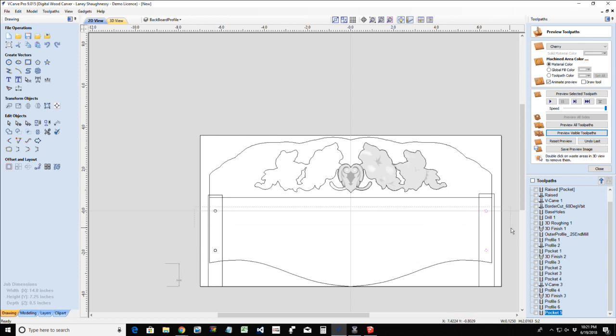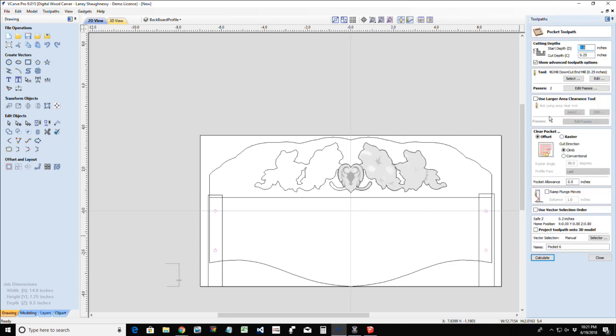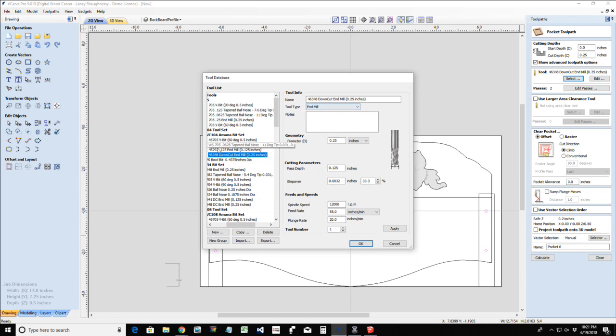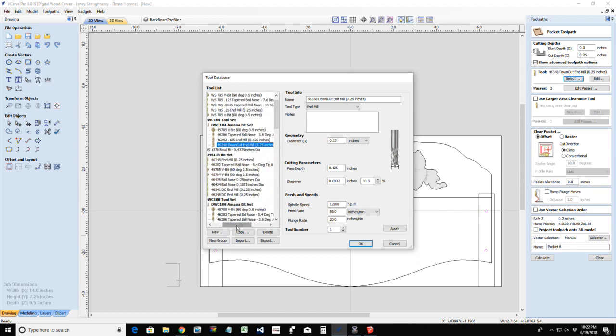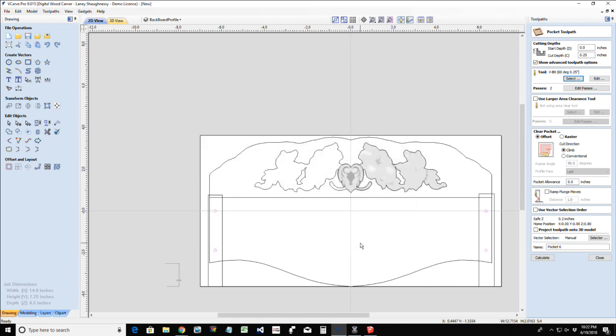And these I'm just going to very simply do a pocket cut with a V-bit. I'm just creating a little dimple. Depending on my screw, if I wanted to pre-drill it with the CNC, if I had an eighth inch end mill, I would, but I just hand drill it because I'm going to be chamfering it from the backside with my chamfer bit in my drill. I'm not going to do that on the CNC. It's not a two-sided project. Let's grab my 60-degree V-bit. And I'm just going to go a small amount.